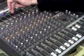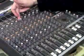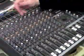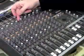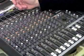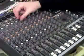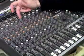work with. Just to say, obviously not all microphones are the same. Some are more sensitive than others, some have different dynamic characteristics. What this allows you to do, the gain control, is to equalise, if you like, all the inputs to a common level that the desk can then work with the other controls. So for a microphone level signal, I use a Shure SM58, quite a common vocal mic. You'd need a fair bit of gain around to maybe the 2 or 3 o'clock position, maybe 2 o'clock position, to get a signal up to suitable strength for the desk to work with